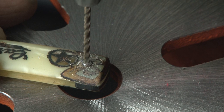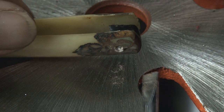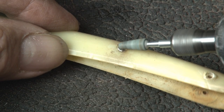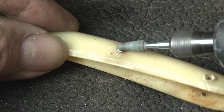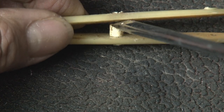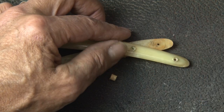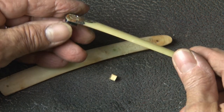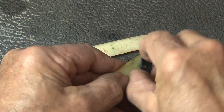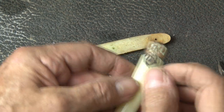These scales are made of celluloid, which was an early plastic used for a lot of different things, but there can be a problem. The plastic can undergo a chemical reaction that basically causes the celluloid to break down — this is called cell rot. When this happens, the celluloid emits a gas which is corrosive and will cause blades to rust. That's probably what happened to this blade. Cell rot can't be stopped, and it will continue to rust blades, so these old celluloid scales have to go.